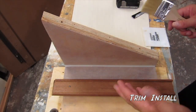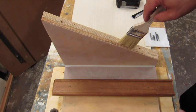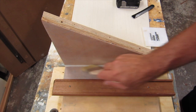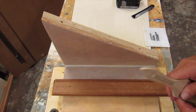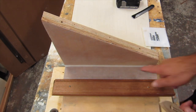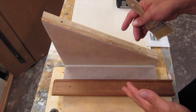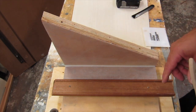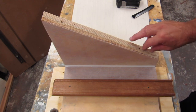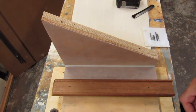Okay, this is going to be very similar to when I attach these pieces. I'm going to wet these two pieces out with unthickened epoxy. I'm also going to put some down here. It has nothing to do with this video segment. I'm just putting it down here because I have to put two coats down here to smooth this out a little bit better. So I'm going to wet them out. I'm going to mix up the rest of the epoxy in the pail with some colloidal silica to thicken it up. I'll apply it on this surface here and then attach this piece back on there, clean it up, and we'll put the plugs in and go from there.